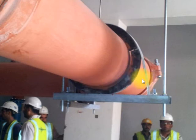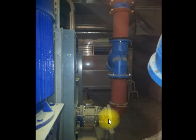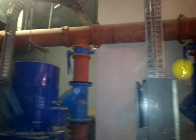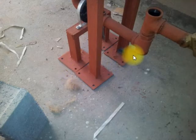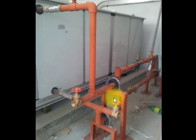There is a gap — this is unconnected, very bad work. You have to maintain the alignment of hangers and everything as per the standards. Here this is also unconnected — not acceptable, should be done properly as per standard. Holding is missing, holding is missing here. They removed the blocks and provided supports, but the support should be bolted — there is no bolting. It should be bolted and rigid. Strong, rigid supports with bolting are required.